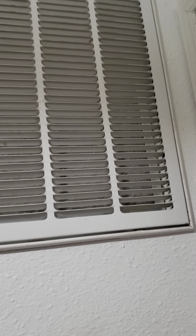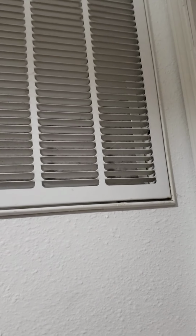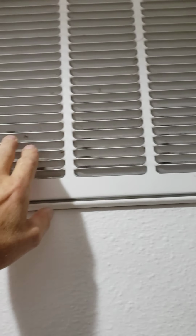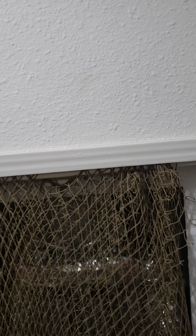I've got a 4-inch fresh air intake with 3 pre-filters on that, with an 80 CFM electrically commutated fan that runs 24/7 except below freezing. The fresh air intake fan feeds into a MERV 11 filter that sits on top of a fresh air UV light filter, and then that's through the intake system inside here. And then on the outside for the house intake, we've got an electrostatic filter to pre-filter the air before it goes into the MERV 11, and then the UV fresh air filter.